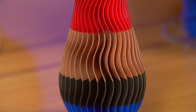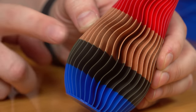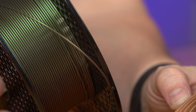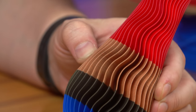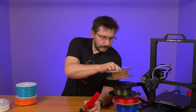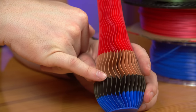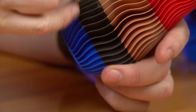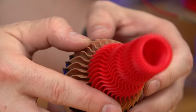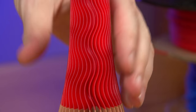This is a fantastic multi-color vase I used to test the filament runout. At the bottom is Creality PLA, then Mystic Green from Prusa — I love that filament — then Polyalchemy FX Sandstone, and above that is Proto-Pasta Raspberry Bliss. Filament runout worked, it detected it and paused. It's not the easiest to get that filament out, and you can see a little string that got caught. But look at it — done. And if you look down the barrel of the vase, there's a really neat pattern. I made it more beautiful by swapping out the filaments.